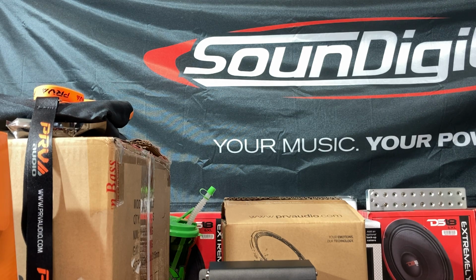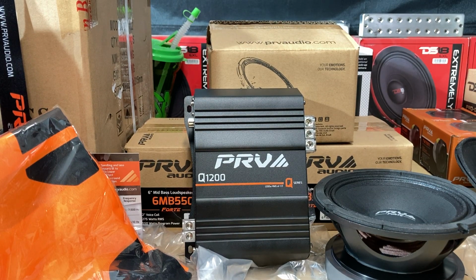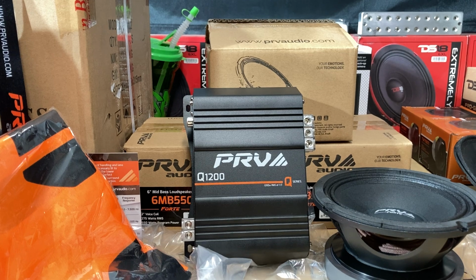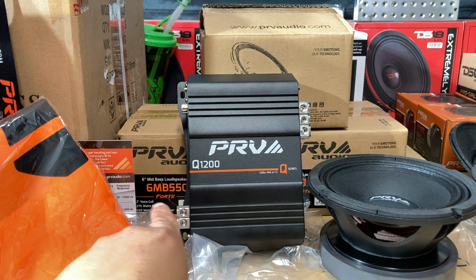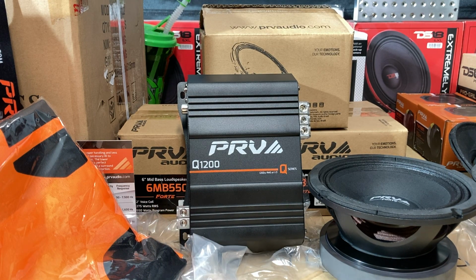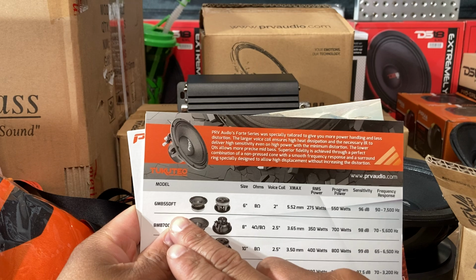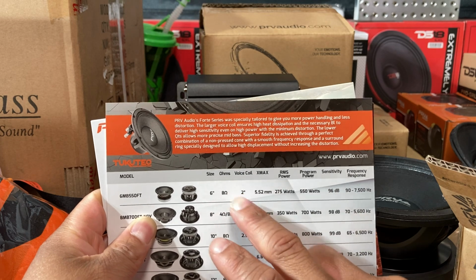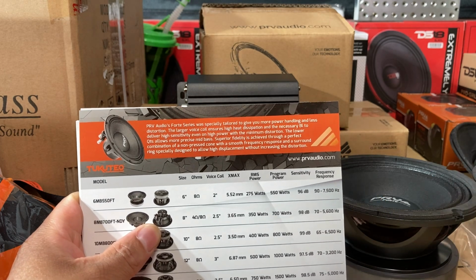But yeah, just doing a video as far as letting everybody know, yes, you see back over there, DS18. That's been my brand for the past 2 years. This time back on the PRV kick. So we'll see what's up with this as far as the PRV Audio speakers, doing the 6MB550FT. So like you see right there, mid-bass speaker. Like I said, go back to this marketing material. This one on the top here is the one that we're looking at. 6-inch speaker, like I said, 6.5, whatever, 8 ohm, 2-inch voice coil, 275 watts compared to the previous model that had 250 watts.